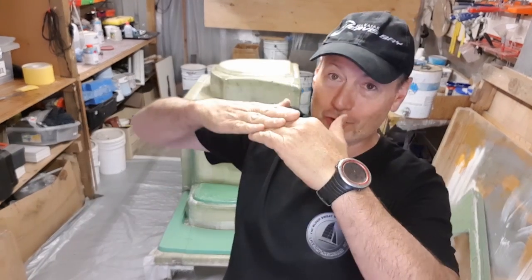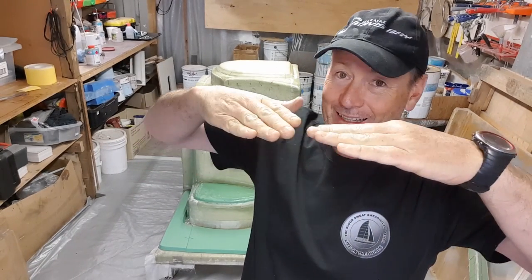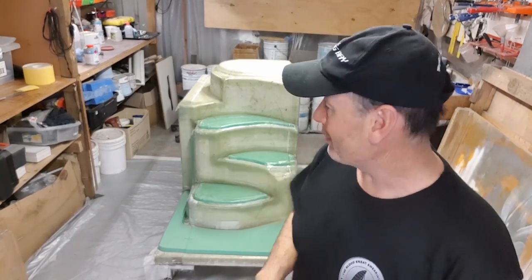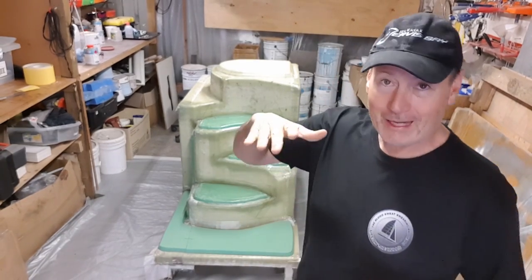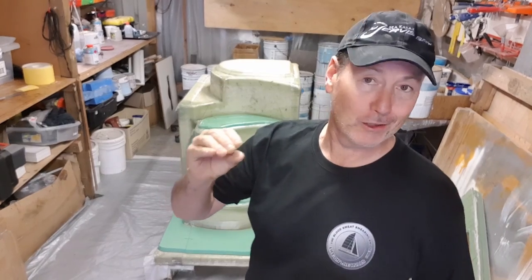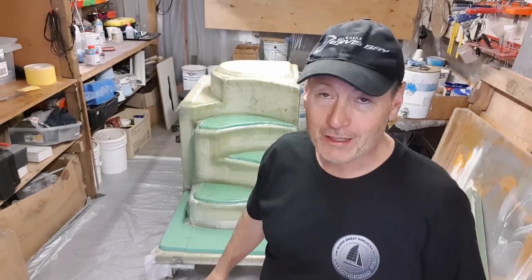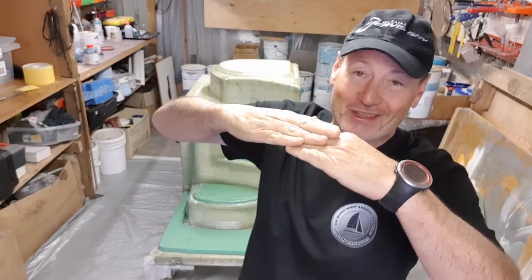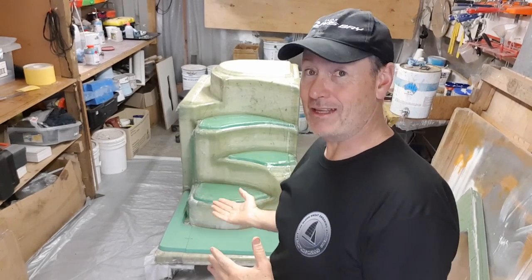And here, she's sitting on top of the chamfer panel where the steps go down, and that part was there, but in fact it is actually hanging. So that means two things. The first thing is that by it hanging, it ultimately needs a lot of support, so it's going to need a similar laminate to the stair tread there. I thought it was actually going to be glassed down onto the physical bridge deck, but because it's hanging, it's going to need exactly the same laminate that those stairs are going to need.